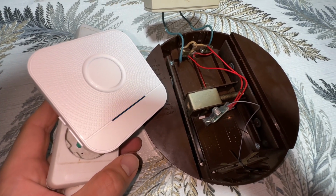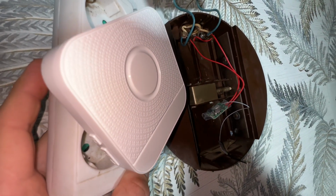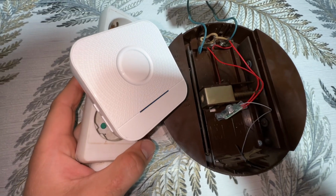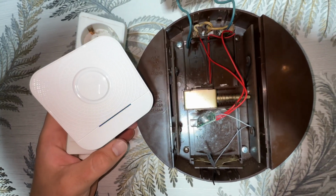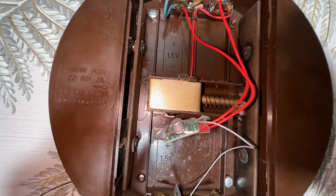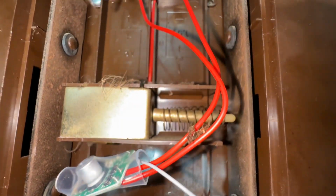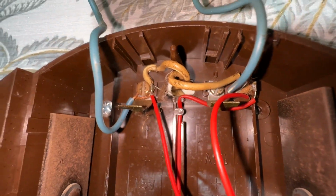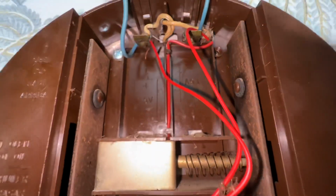The Bitiwend radio transmitter for electromechanical and mechanical bells and chimes is possible to install easily. The marked cable plus and minus do not have to be distinguished between positive and negative poles and are therefore easy to install. The wireless bell receiver with 433 MHz plus minus 40 kHz connects to the transmitter in the open field range of up to 200 meters of range. Of course, indoor it's not so much, but indoor I think it's 50 meters. But this is only approximate.